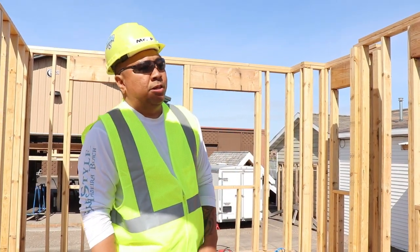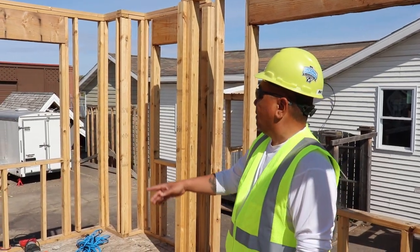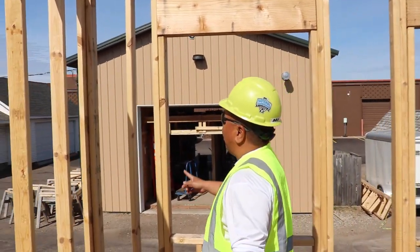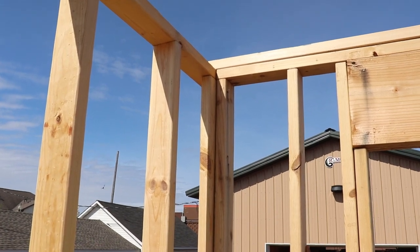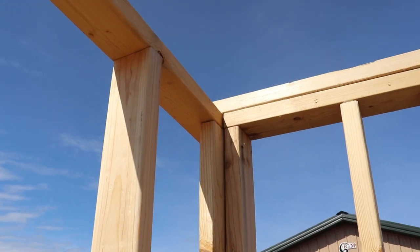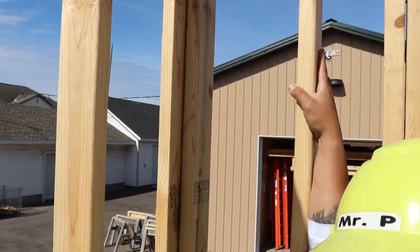Come and look closely here at how these walls are supposed to be. Look at this corner right over here — how this cut wall here ties over this wall. That tells you this wall is a short wall, a butt wall, that goes on top of the long wall. So you want to take this wall down first and keep this wall up.